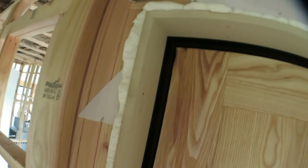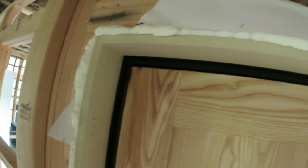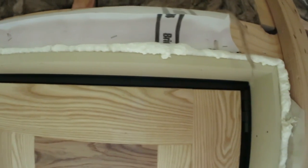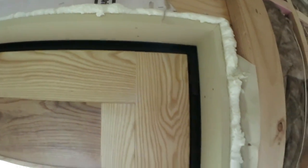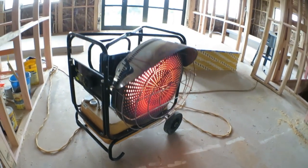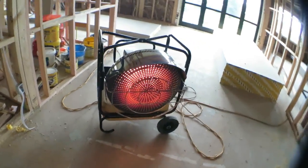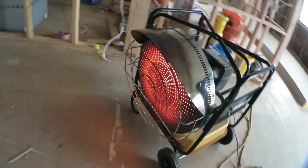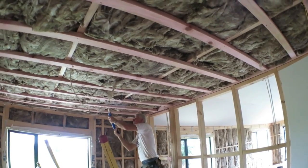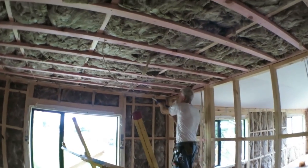On the inside of all the doors and windows, the gap between the door jamb and the framing — we have to leave a 10 to 15mm gap, put a backing rod in that gap, then the expanding foam, and then it's cleaned off before the plasterboard goes on. The bottom plates of some of the walls were too wet to put the plasterboard on, so we had to get a big heater in to try and dry things out. We were allowed to carry on with ceilings and tops of walls, so that's what dad got on to.